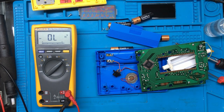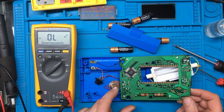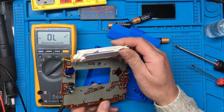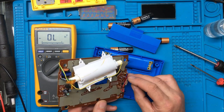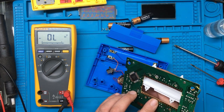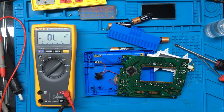What else have we got on here? There's a couple of tantalum bead capacitors there. Unless one of those has gone short — it's a pity it's not easy to switch on. I think I'll just clean those contacts up quick just to see if that makes any difference, but it looks like there's a short or something somewhere.